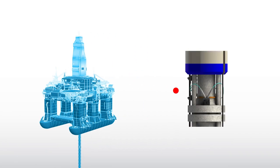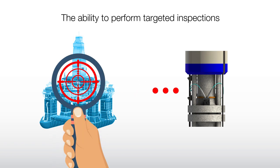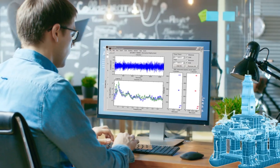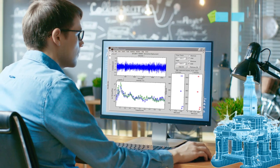The digital twin is then calibrated by actual riser load measurements from a subsea vibration data logger, giving operators the ability to perform targeted inspections. Once tuned, the digital twin can be used to predict the damage state for the riser and rig over time.